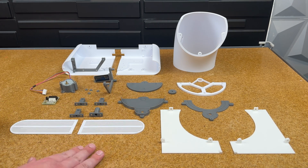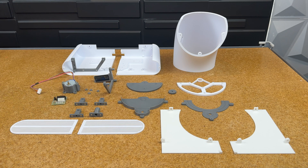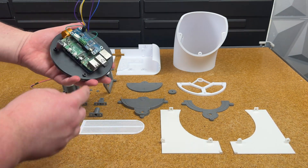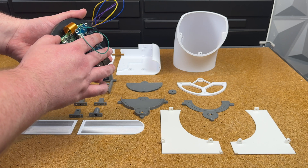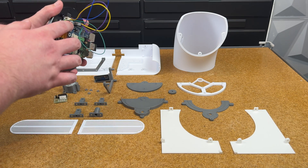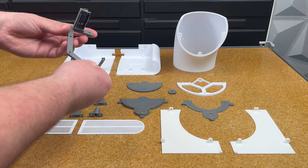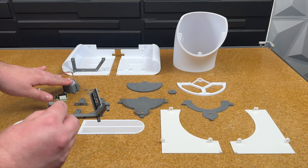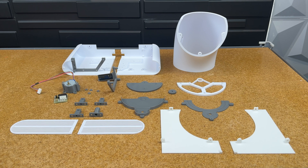The one thing I did with this is I wanted the option to not have to use the stepper motor and the Arduino. Originally, I was just going to run the stepper motor off of the GPIO pins on the Pi. However, trying to get this to work with the speaker hat, there was just a ton of interference and it was not happy — this would stop working as the motor moved. So initially I just kind of canned it. But then I thought I could just pop an Arduino in as an option — just a Nano, because this is super tiny, easy to use, and cheap. Then it still has some form of head movement, but it's not as integrated with the Pi as it originally was going to be. Basically, I just have two versions of some of the parts.